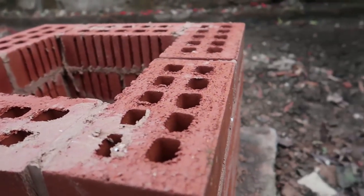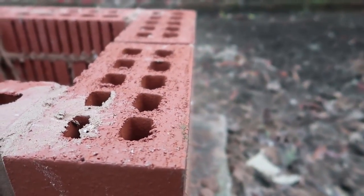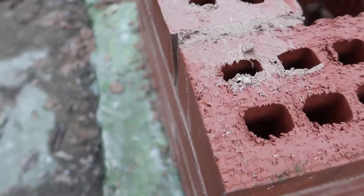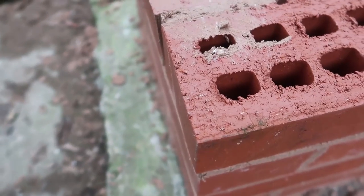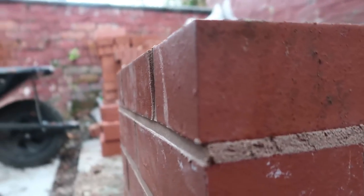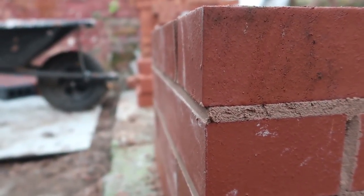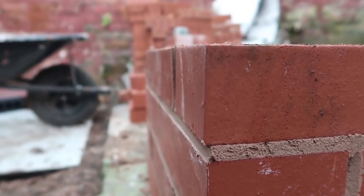Now on the return it's fine — it's in line with that brick there, ranged in. It's ranged in with that, it's not like it's kicking out. But then the return just has that little edge there. You can throw it out — look on the lip there. Looks like it's lipped out, really it's not. So you have to watch things like that, because when you're plumbing up you might think your brick was plumb but it's not — it's actually some of the bricks themselves.